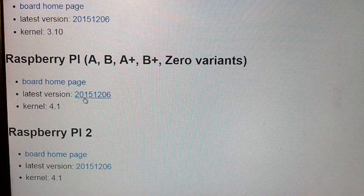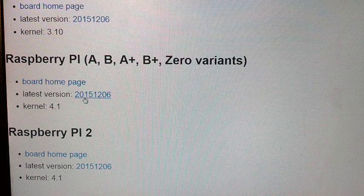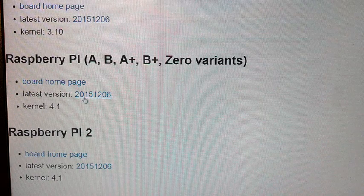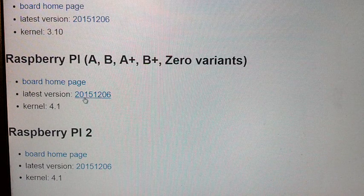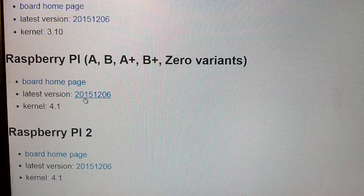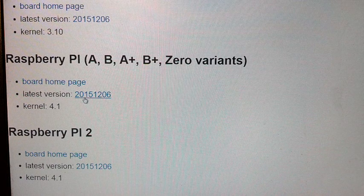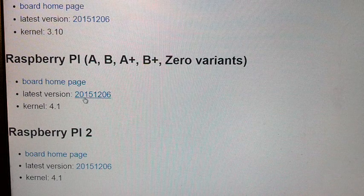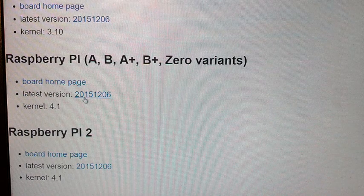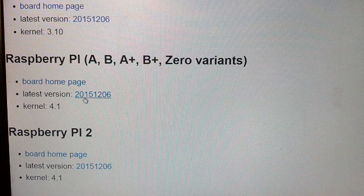Use this link to the original creator's webpage and you'll get the current version — it's also good for other boards. The Raspberry Pi 2 is so much faster. This old one is just going to be used as a DVR. I think it's going to have more power than my actual DVR system, and I believe we can keep adding cameras. I'm going to be using webcams, but you can use remote cams. Anything USB — and based on your power supply, you may need to run through a hub to give enough power to the cameras. I know at least one HD camera works, and HD webcams are pretty cheap. Let me wait until this is done and then I'll burn it to an image as per my other video.